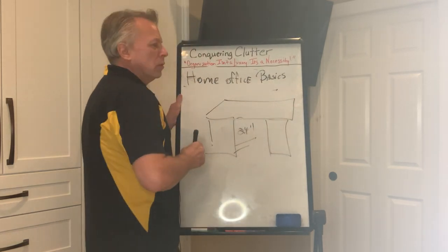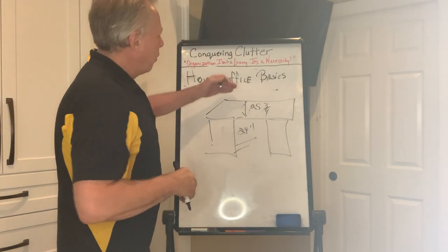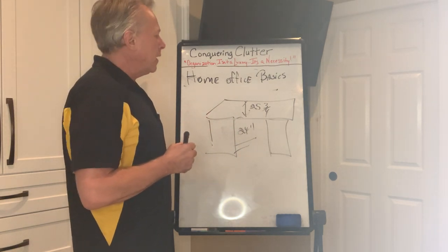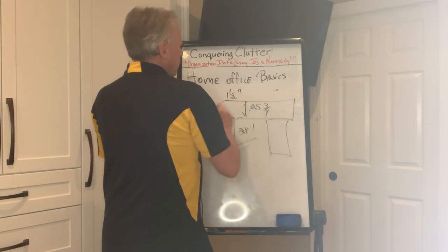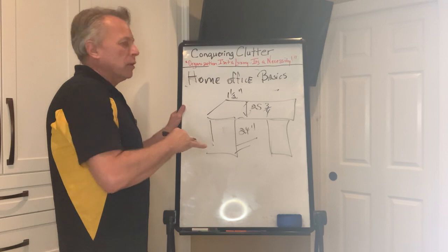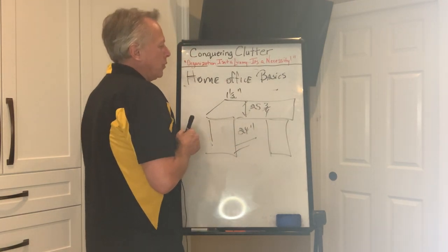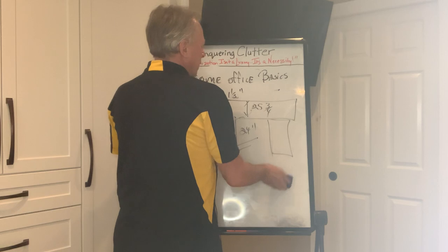We try to make the counter depth from the wall 25 and 3/8 inches. This gives you a little overhang, because your drawer fronts on the 24-inch cabinet are three-quarter inches deep, so you end up with 24 and three-quarters plus a bit more overhang. Countertops are usually an inch and a half thick — unless you're doing a granite slab, they'll put plywood down and cover it with three-quarter-inch granite on top, then paste the sides for that thick look. Your computer won't be too far back and everything is within reach.